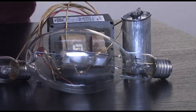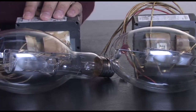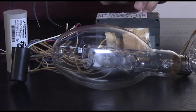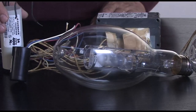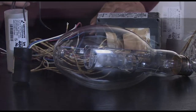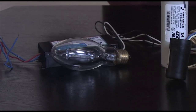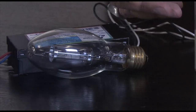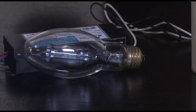The capacitor helps to convert volts and amps into watts or power. The middle one here is an M135, firing a pulse start 400 watt metal halide — M for metal halide, 135 for a 400 watt pulse start lamp. This has an external capacitor and an external igniter used in a pulse start system. The last one is an M143 metal halide pulse start ballast, where the igniter and the capacitor are inside the ballast. This drives a 70 watt ceramic discharge metal halide lamp.